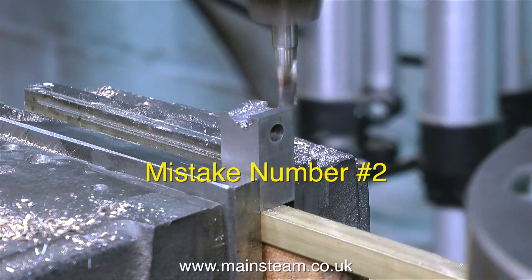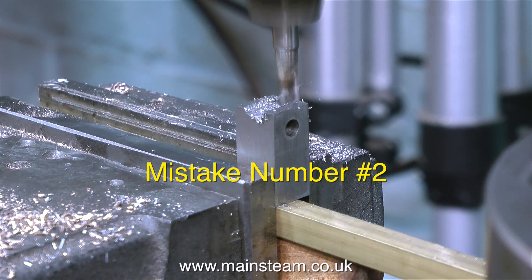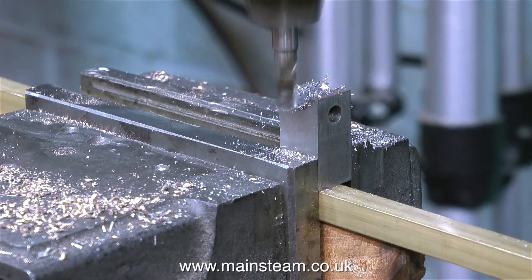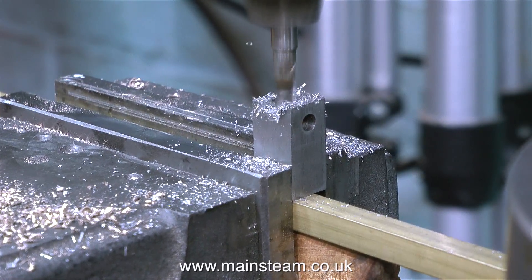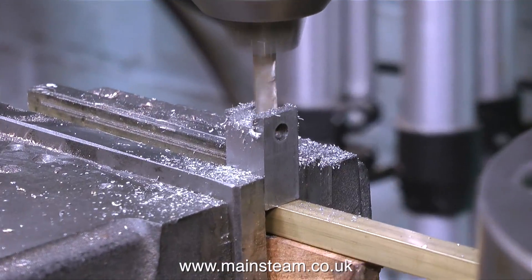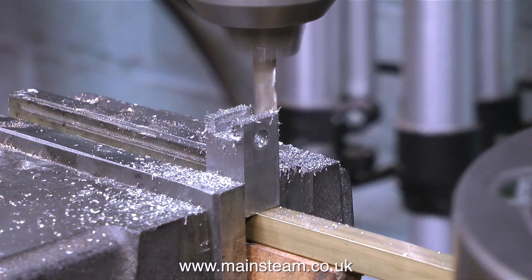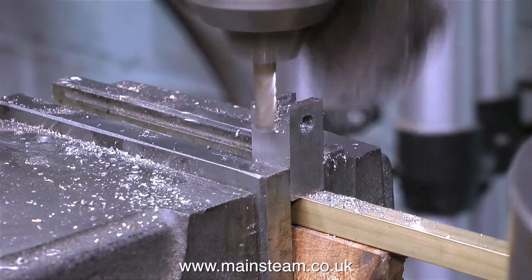However, this isn't the mistake. The mistake is using an extremely blunt slot drill that I picked out of my drawer of old and extremely blunt slot drills. This is to simulate the fact that most beginners do not have an excess of equipment, and often as a beginner you have to use what you've got. I removed the old and blunt slot drill and replaced it with a nice sharp end mill. And now, as you can see, it's cutting much better. I'm having to apply far less pressure to the hand wheel to move the cutter across the work, and it's cutting much more freely and without the burrs.